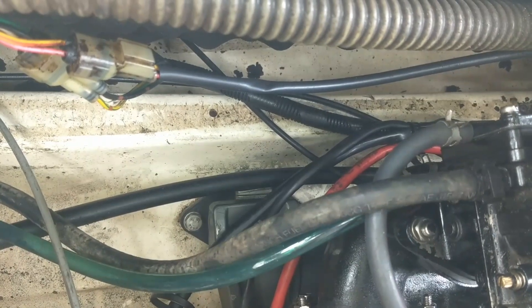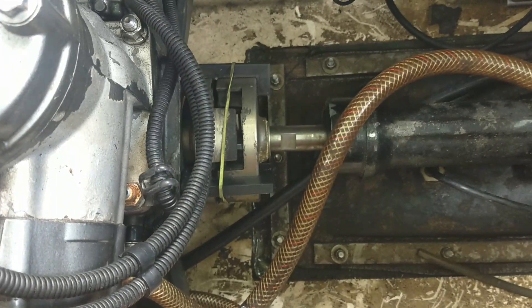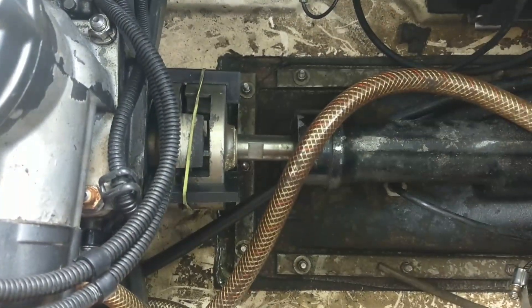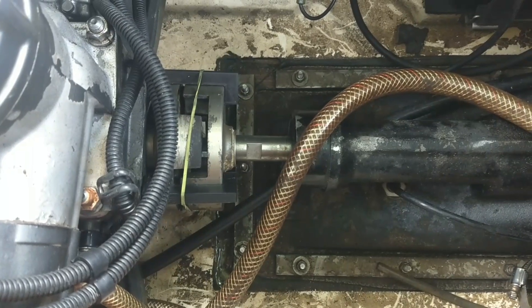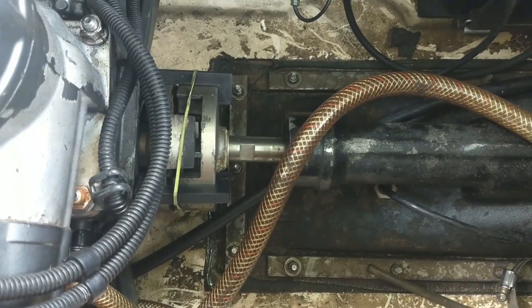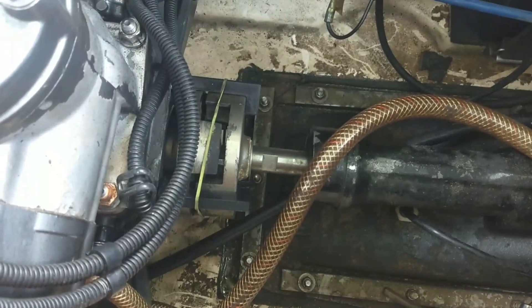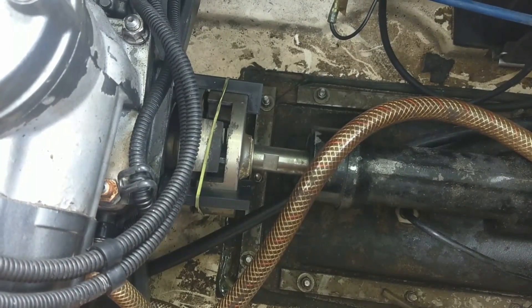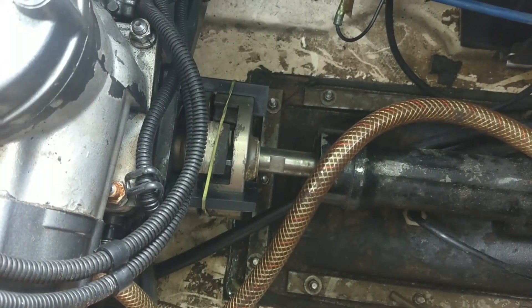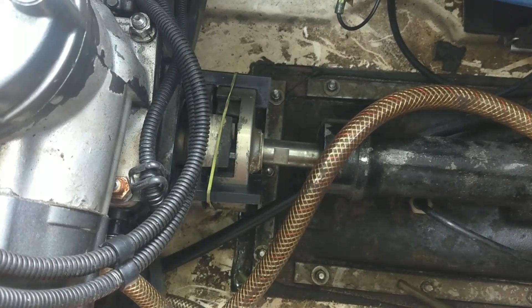Got that all shimmed in place, and I got my spacing correct. Now I need to put the coupler in. To do that, you basically have to undo everything you did, slide the motor back, fit the coupling in — the shims stay in place. You then jockey the motor around until it lines up nicely, and then I'm going to put these alignment pieces back on to make sure I'm left to right, back to front, where I want to be.